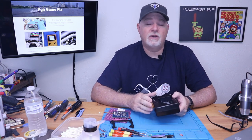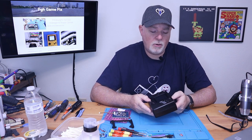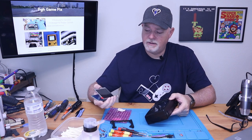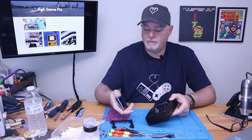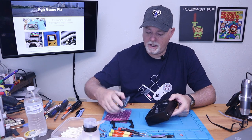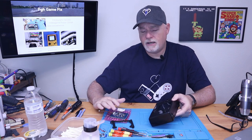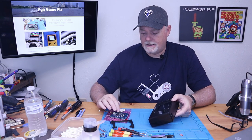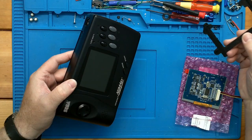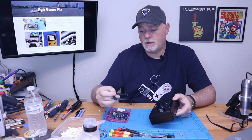Now, I know on some of my other videos, we have done IPS screens and a few others. The nice thing about the Nomad, since it already has a video out, is we can use inexpensive TFT style boards. This particular one is only about $12 or $13 from Console 5. And it's designed to run off 12 volts. And we'll have to do a mod to make it run off the battery pack or the 5 volts internal. And of course we need a 3D printed bracket, and that will be another video coming up.